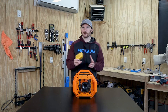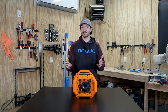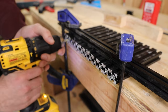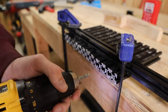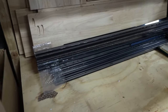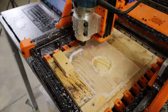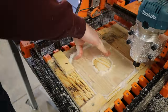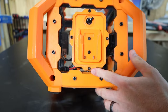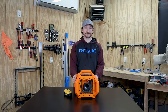Something I want to try including in more of my videos is a post-mortem analysis to talk about the parts of each project that didn't go well. First off, I ordered the wrong extrusions, which ended up costing me time, money, and extra filament as I tried to design around using the M6 bolts — in the end I had to switch back to the ones with 4.2 millimeter center holes. Next, I wasted even more money by cutting the acrylic wrong and having to use my backup sheet. Cutting the entire outline of the acrylic on my CNC ended up working perfectly, until I made yet another mistake when I set the workpiece dimensions wrong and the battery mounting panel ended up about a quarter of an inch off center. It's not a huge deal — I can always recut that panel — but it's just more wasted time and money.